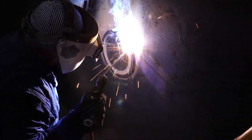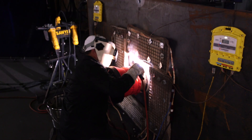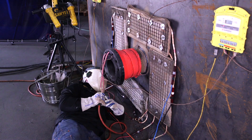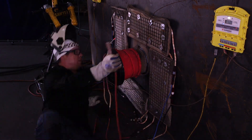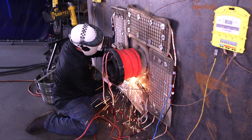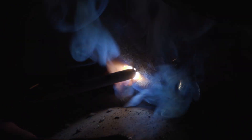Once I start coming to that curve, I'll start again towards the top, sweep down, towards the top, sweep down. On the bottom coming up, you call that dead man's curve — that's where it wants to just sag. Going into my third bead here, this is going to be the final one on the outside of the plate. I just want to make sure I cover up that bevel edge and not undercut the plate itself. Just try to keep it nice, clean and consistent, with a nice even overlap on the beads.